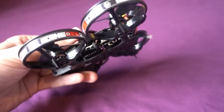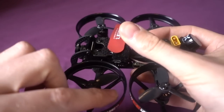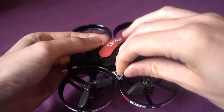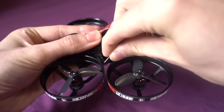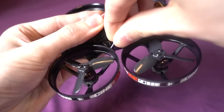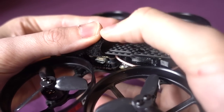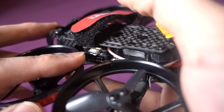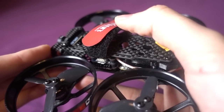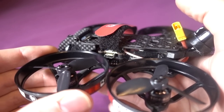So this one's flight controller is an F4 and not an F7, and because it's mounted up front, you can't access the USB port, so they've included this 90 degree adapter, but as you can see, the protector is still in the way of that. So I knew once this thing was in, I needed to get my setup right, because I had a feeling that on the way out, it was going to take the USB connector with it, and guess what? It did. You can't see it because I've attempted to solder it back on, but it stripped off the USB solder pads, so there is no saving it. Luckily, I got enough things set up so that it would arm, but I can't really touch it from here other than what you can do through the on-screen display.